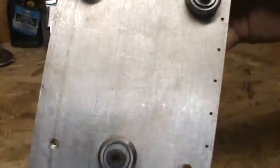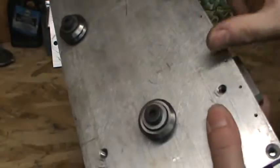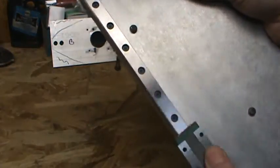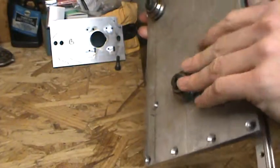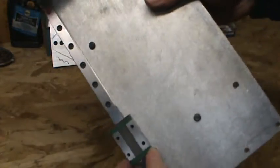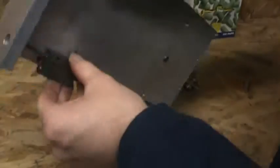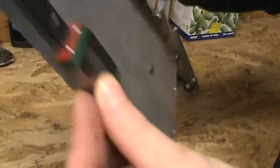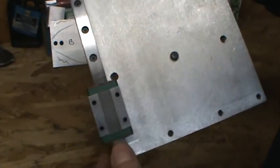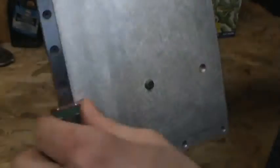My Y and Z axis: for the Y-axis it's just V rollers — three of them for right now — and I have a piece of 3/16 by 4-inch steel that this rolls back and forth on. It rolls pretty well. I'm a little concerned about my gantry weight, but for right now I think it'll be okay. For my Z-axis I decided to go with these really slick linear ball bearing ways — they're super smooth. I've got to buy another one; they're like 30 bucks on Amazon.